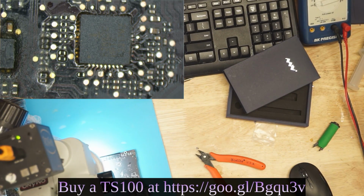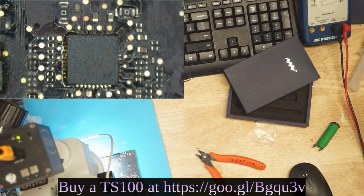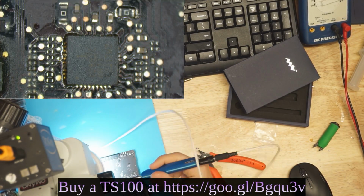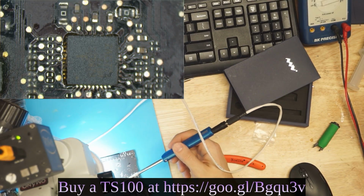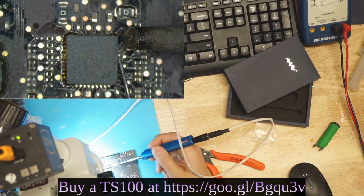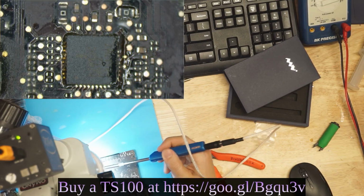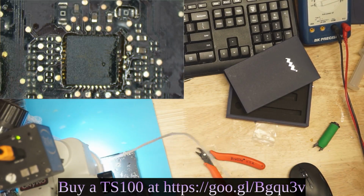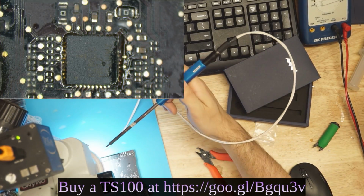One thing that's actually annoying here is the wire. If you're going to get a wire for this, don't use speaker wire like we did, because it kind of wraps around you. If you're going to use this for yourself, make sure the wire you use to attach it to the power supply feels like a microphone cable or something, but a really thin one. Some nice silicone wire or something.